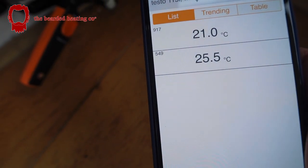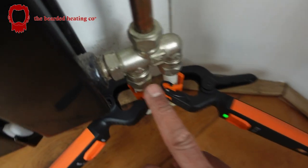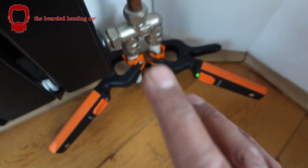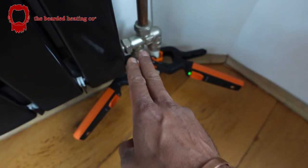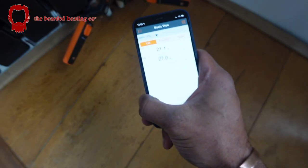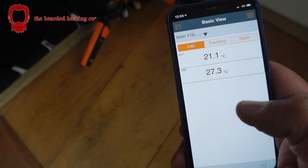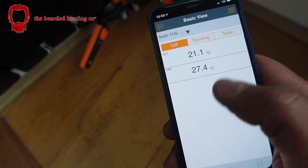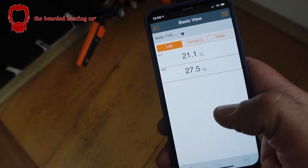Moving to this side — this one is 917, I'll put that here, and 549 on this one. Now let's see what's happening. Again, 549 is getting hotter quicker — which is the left one — but again the arrow is on the return side. So as you can see, this is where the mistakes happened. I'm going to change this foot valve and put it on that rad, and that one from there put it over here. This is how I proved to the customer that it was wrong — I showed him my phone with the clamps set on the pipework. This makes fault finding and explaining to customers what's going on a lot easier.